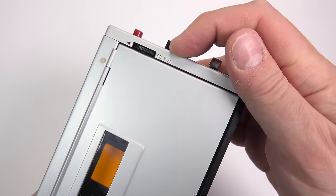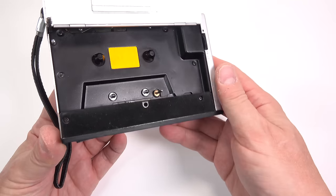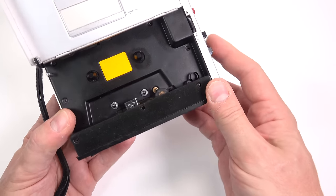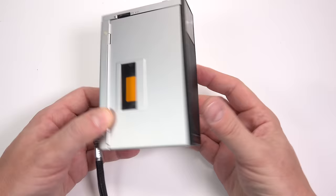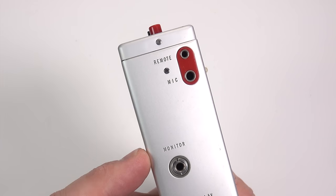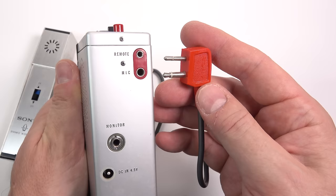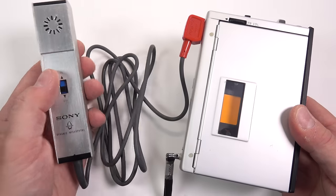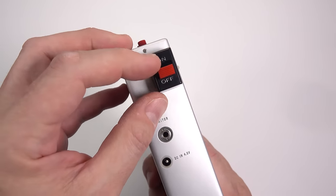The volume control is marked PBVOL to show it only affects the playback and not the record level. These two plastic stoppers at the top are what the door rests on when it's open, and there's very little plastic in this machine — all the cassette compartment is made out of metal. There's a strip of velvet along the bottom over the head cover, there to ensure that when the spring-loaded door is closed, it does so silently. It's this kind of attention to detail that shows the care that went into putting this together. Above the wrist strap on the side, we've got the DC power input, an earphone output, and at the top a microphone input with a remote control socket. I've got the microphone here, and you can see that it's a beautiful, minimalist, 1960s design. When this plugs into the machine, it plugs into both the mic and the remote sockets, which means the switch on the front of the mic is able to start and stop the machine recording. You can also plug in an accessory into the side which effectively acts like a pause button, giving that same start/stop functionality while using the built-in microphone.